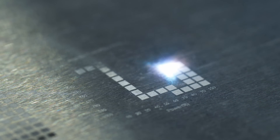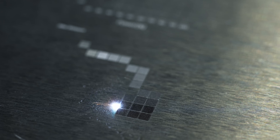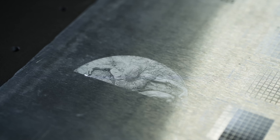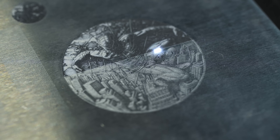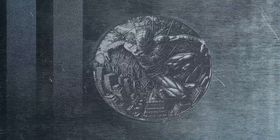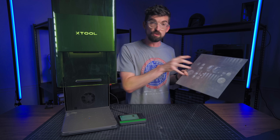In addition to brass, I also did aluminum testing. Higher power means you can get different types of color inside aluminum — I could get a bluish color, white, as well as black. Instead of just doing a picture engrave like this Spider-Man that is just white, you can do a two-layer engrave: a white pass, then invert the image and do a black pass. The result is really cool — you get two different shades depending on the angle. With the two-watt laser, you really couldn't get the darker engraving unless running at super slow speed, but you can do that easily with the 20-watt fiber.